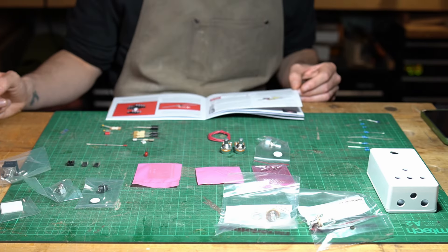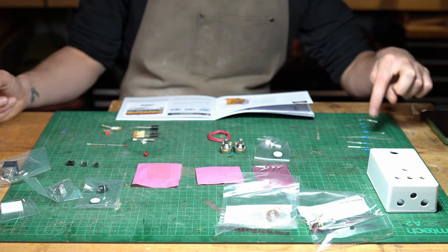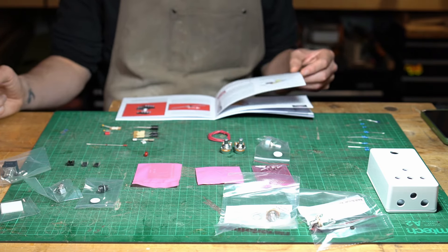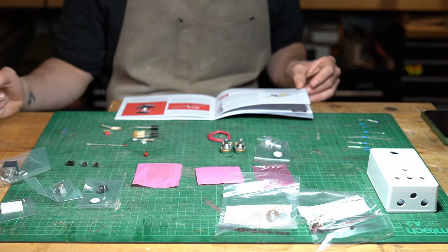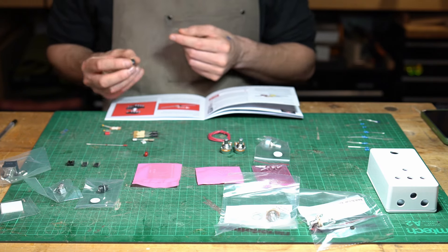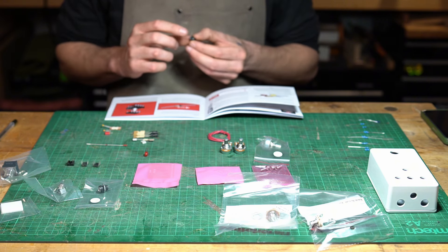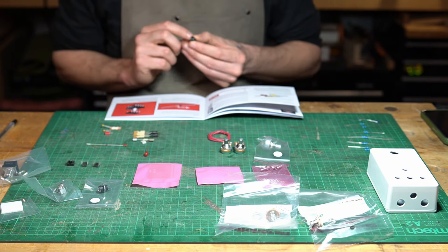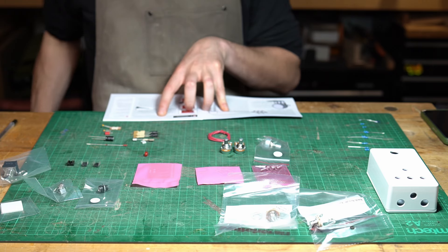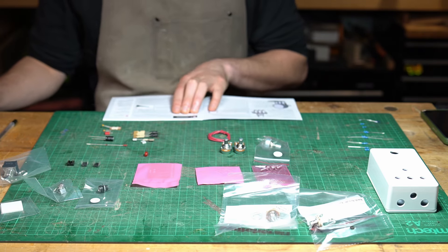This manual is like a high school textbook for electronics. I'm going to dive into the detail of understanding resistors and their values at a later date, but this is very impressive — the last kit I did didn't have any of that and just told you where to solder things. Very important: the polarity of components, meaning which way round they go, whether positive or negative. The shorter leads are the negative and the longer ones are the positive, so it's very important they're put the right way around, otherwise this pedal's not going to work. Soldering joints on the circuit board are very small and too much heat can damage the board — I know that from experience.